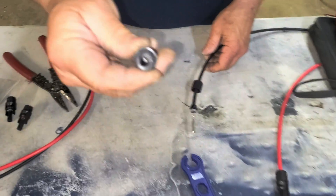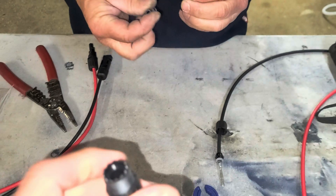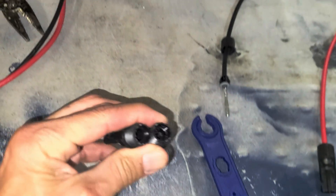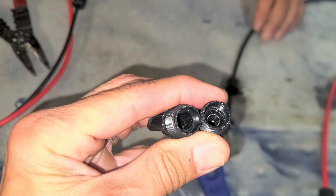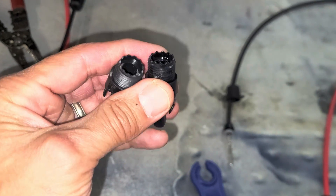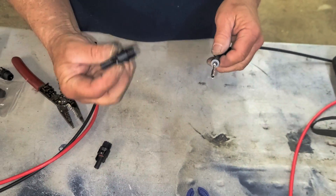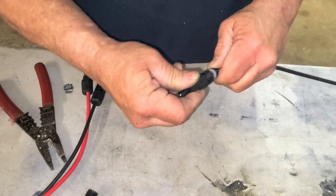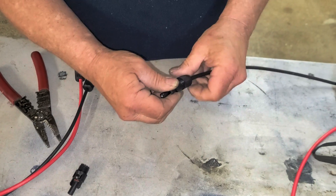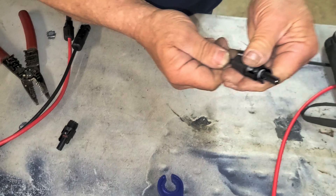This one does not have a sleeve, and this one has a sleeve. The one on the right has a little metal sleeve inside; the other one doesn't — there's nothing for the pin to seat on. We'll put the sleeved one on to show how it snaps in place — hear that click? It's solid. That's what the nut is for: you tighten it up and it cinches around the insulation, keeping it from moving.